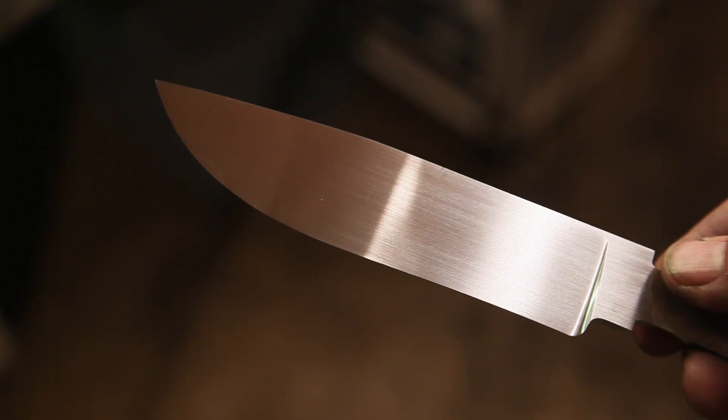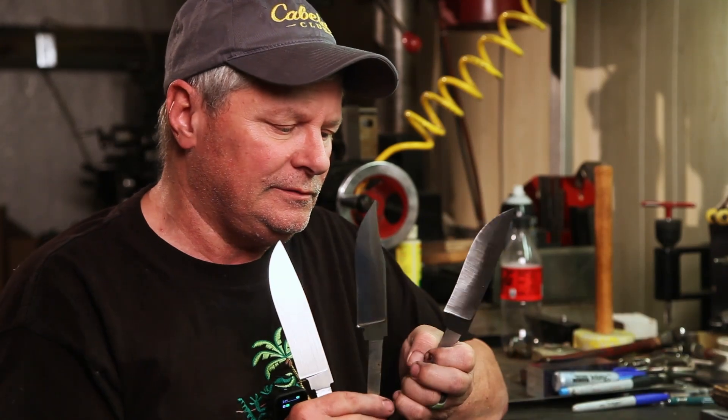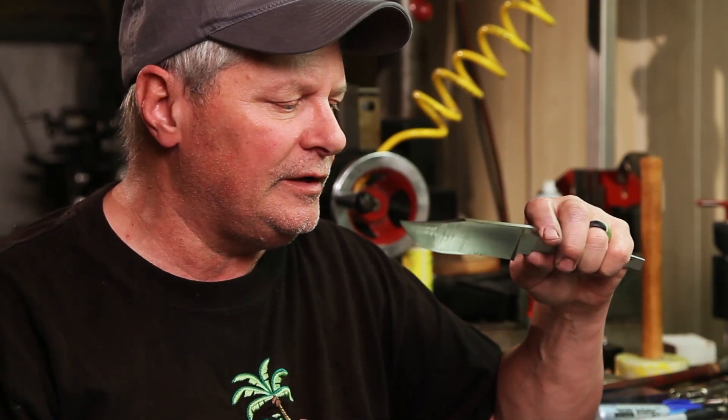We got our blade ground, and I went ahead and hand sanded it. My edge turned out to be around 17 thousandths, which is where I like to be — somewhere around 20 or under. I went ahead and ground and cleaned up the ricasso area. Now it's time to start working on the guard. I also ground the other two blades; they haven't been hand sanded but that's the next project for them. This blade is going to be a frame handle — a neat little small vest bowie — and this one is a feather drop point. We're going to have to work on the guard on the next video because we're out of time. Thanks for watching, and thank you to my patrons — see you on the next one.